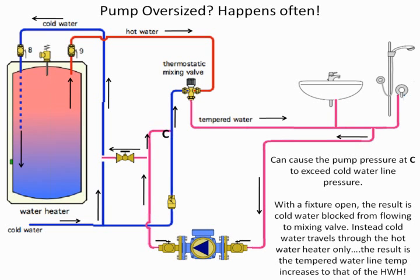All right, so we've got to make sure that we put in the right size pump. You know, typically this is a very small pump. And the pump manufacturers, all their engineers know how small these are supposed to be, and they're providing these to the industry. I appreciate that greatly. I have seen systems where it's been a 1/16 of a horse, a 1/24 of a horse. We're talking small in size. I did a recent commercial building, rather large in size, and we had a 1/4 horse pump. And guys looked at us and go, you can't move anything for a 1/4 horse. And the answer is, sure you can. So 1/4 horse pump for that large project worked fine.